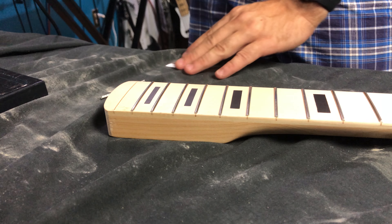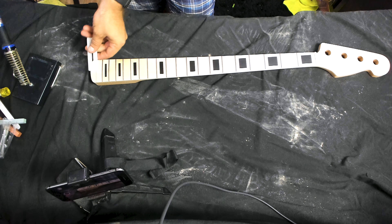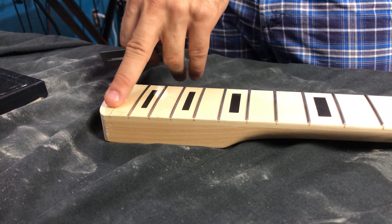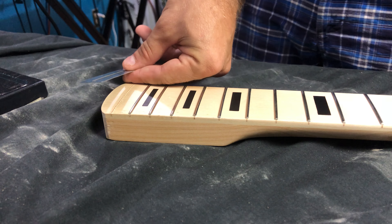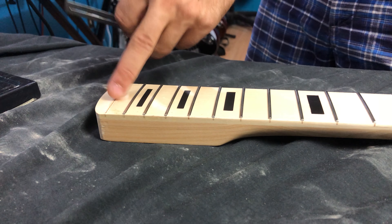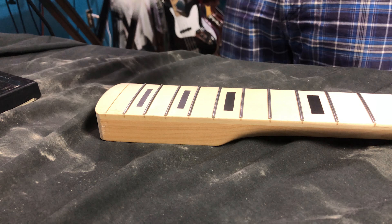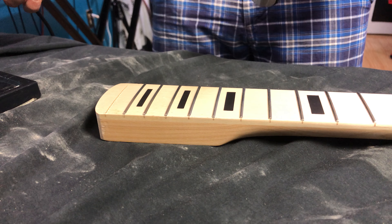Initially, on my first fret — you'll see I've already removed one before recording this — I think I've discolored the maple fretboard by applying a little bit too much heat. I used this protective shield to make sure I didn't hit anywhere on the maple fretboard, but it imparted a small scratch. So I am not going to be using this, but the technique will remain the same.